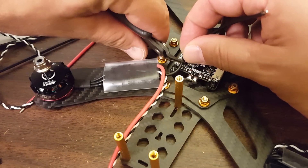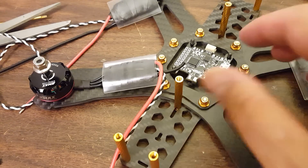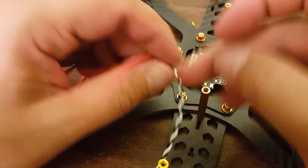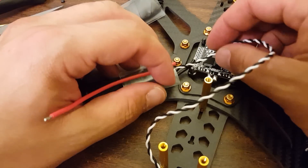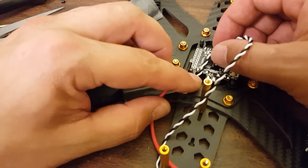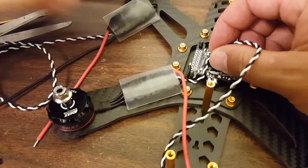This is tight — this is a tight, no-fooling soldering right here. There's not a lot of room to get in there and do what you need to do. I almost think I ought to solder the signal wire first because it's smaller and the tip of the soldering iron needs to get in there. This flight controller is not for the faint of heart.